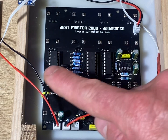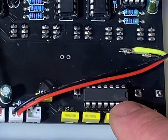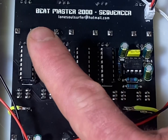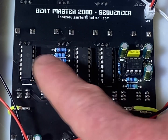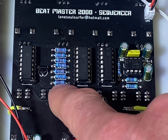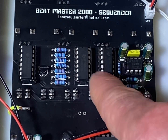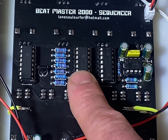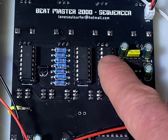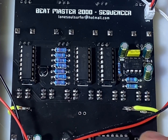On this side you can see there are four chips. These are CMOS chips - a hex inverter, the 40106, which provides the oscillators. Up here you have a multiplexer - two multiplexers - one is for the envelope generator. This resistor ladder here provides the envelope generator, connected to a 4040 which is here, and there's another 4051 here which is for the sequencer. When you connect two of the connections together from the 4040, you can use these switches to get some different unique sounds.